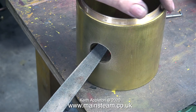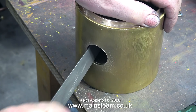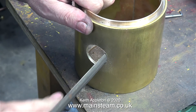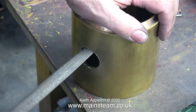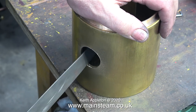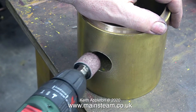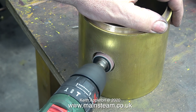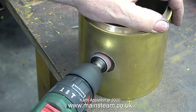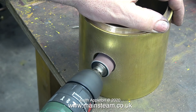There is another way to do this job and surprisingly it's very simple — a half round file. Some viewers may be thinking, why not machine the hole? Well yes, that would be a good idea. I could clamp it to the milling machine table and use a fly cutter, or even a specialised boring tool. But please remember, particularly the viewers who complain all the time, these tutorial videos are made specifically for beginners. Many beginners do not have the machinery to do a job other than the way I'm showing. This way shows that everyone can do it and you do not need specialist expensive equipment.